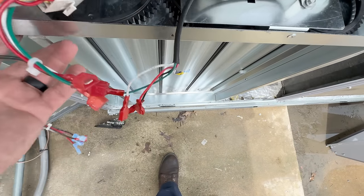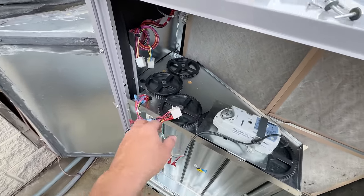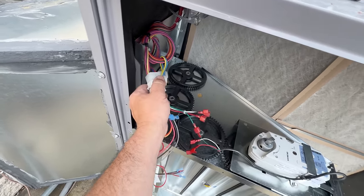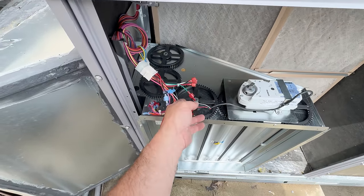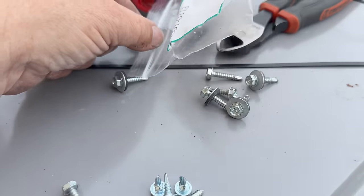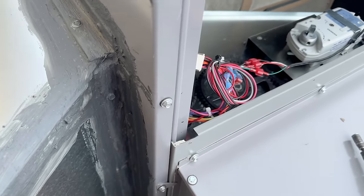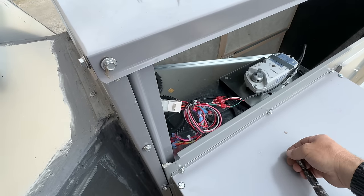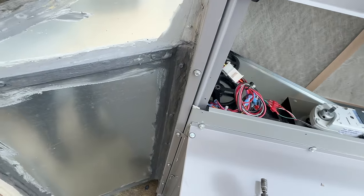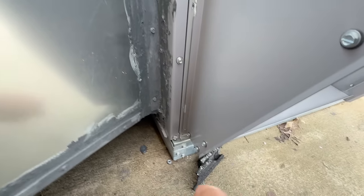It's all the way screwed in. Looking at it, there seems to be more material on one side than the other — but not my monkey, not my circus. This is the first Siemens I've done. The horizontal economizer has always been an issue — I've had this happen before. We're going to wire-tie the cables so they don't get caught in the gears. I notice the bag of smaller screws — I think you're supposed to use those short silver ones instead of the long ones that were installed, which were pushing things out and causing the bind.